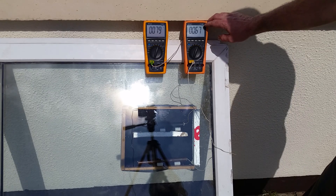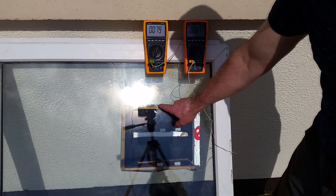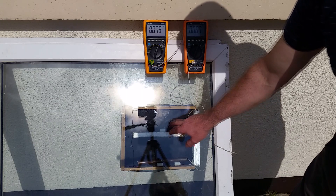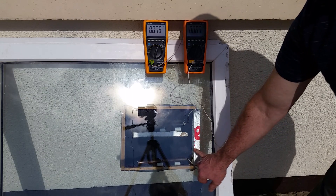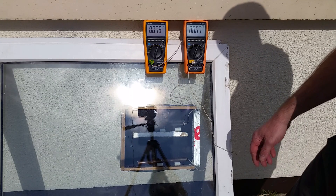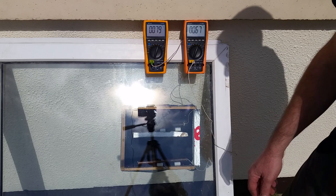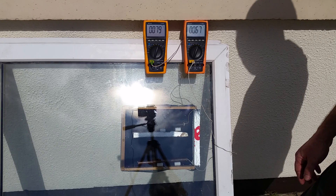67 at the minute, 79, very bright sunshine, and it's going well. Just to explain the box: this is just some inch-and-a-quarter timber, hot-glued and dabbed onto the glass just to hold it there. I put a divider in which was insulated, just to act as a separator. The whole enclosure is sealed off so that we can't get air blowing by cooling down the pipes. I also blocked off the pipes so that we wouldn't have air flowing through the pipe cooling them down, because we're going to have water in that — it'll be sealed in any case. So 79 and 67 is brilliant.